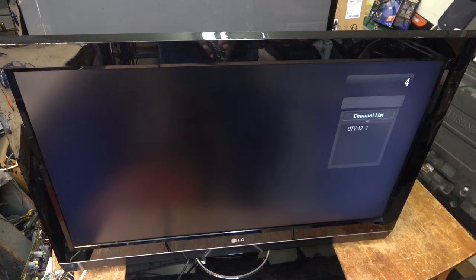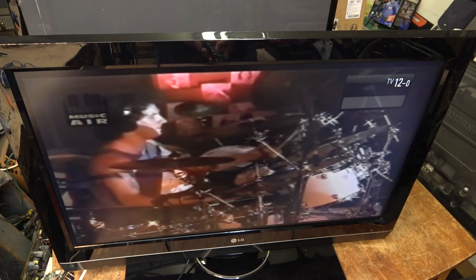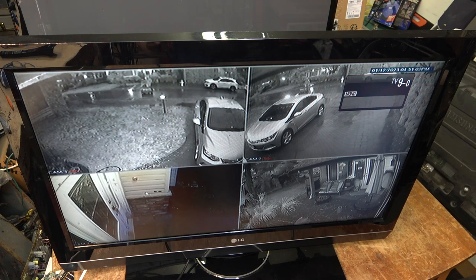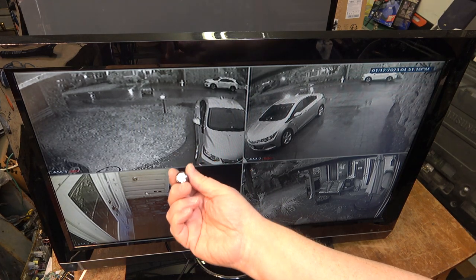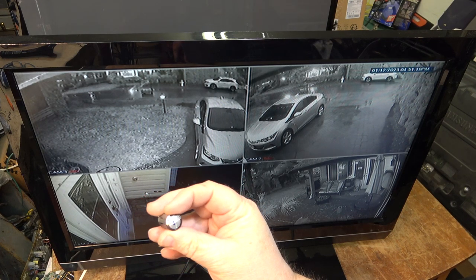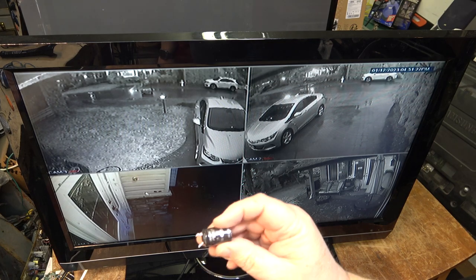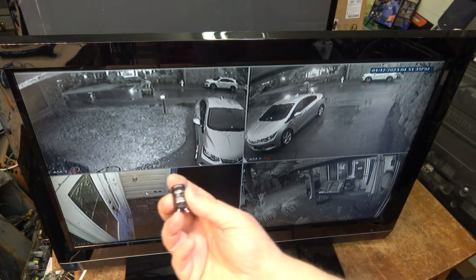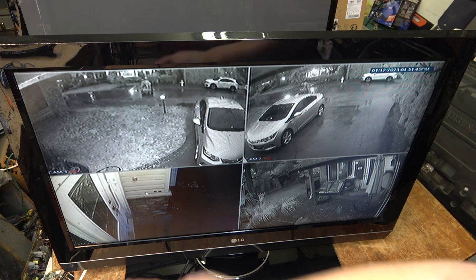So this one is working. That's how simple this one was — one cap that failed in the power supply. This one I just happened to notice when I pulled the back off. It's not blown completely, the top's not bulging totally — I just noticed when I looked at it that the top didn't look quite flat, just the way the light caught it. One cap was bad. When we measured it, the ESR had gone up and the capacitance had dropped from 1500 to about 500, so there was too much excessive ripple, probably in one of the supplies.